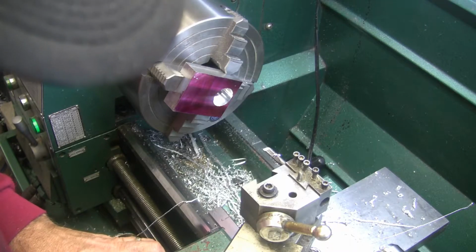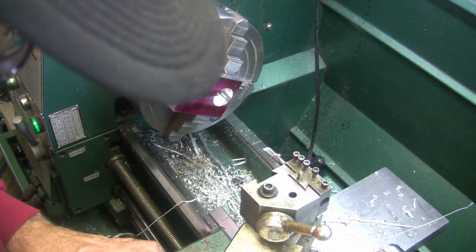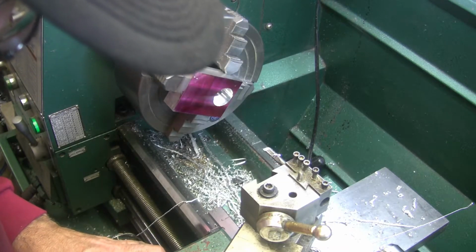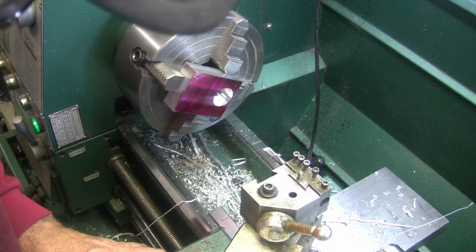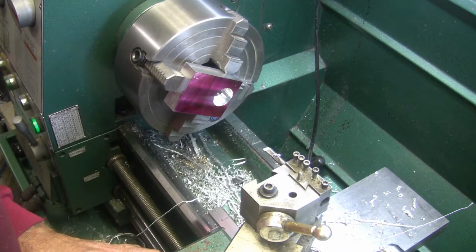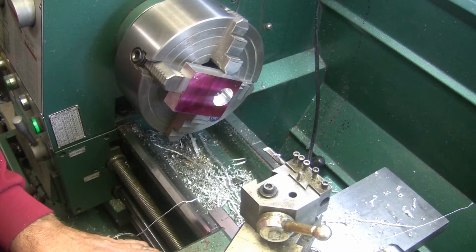So we want to go 9 thou. I'm gonna go 8. My handle fell down and moved my indicator, or moved my carriage. I hate that. I did put a counterweight on it, but it fell off. I need to someday fix that permanently. You know what? I'm going to take the handle off that right now.